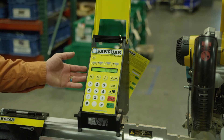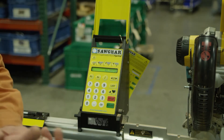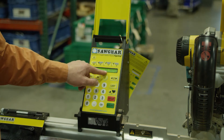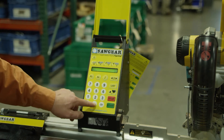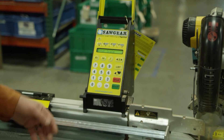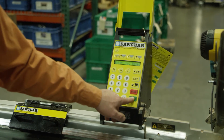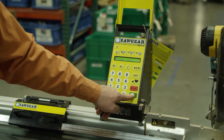To adjust scale, we typically raise or lower our working length by .003 depending on how far it's off. We're going to raise this by .003 and set it to 48.560. Press start. Next it goes to our scale — leave that alone and press start — then there are a couple of other settings for throttle that we'll leave alone as well. Press start to get through those and you'll arrive at the home screen.